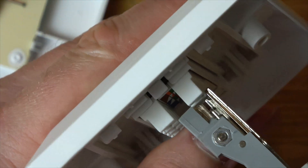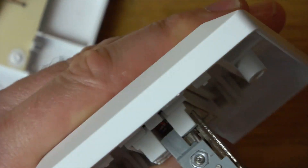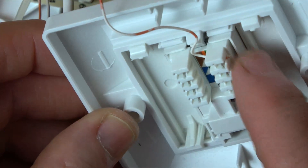It's the same if you look closely at the RJ45 sockets — the ethernet sockets — you have a shoulder on one side. The shoulder is where the cutting blade is going to go. So when you put your wire in, let's do this one here and push down. You do it vertically as well. It cuts off the excess, and you can see the wire goes in from that side and it gets cut here.